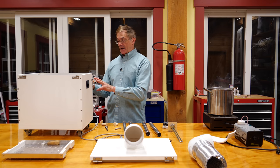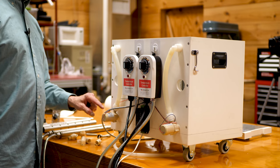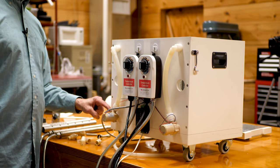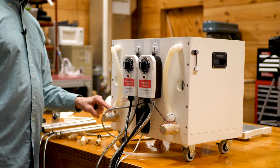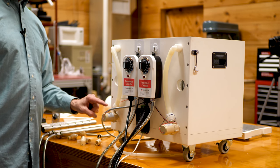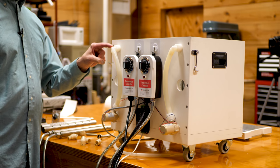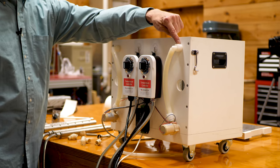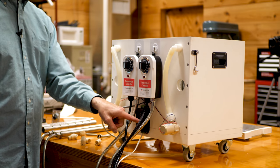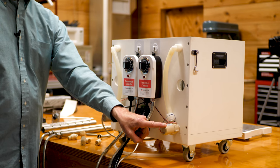On the back surface most of the action is happening. I've hooked up a couple of these solar water heater pumps — I really like these pumps. I bought them for about $20 each in quantity, but you can get them for about $28 to $30 each on Amazon. They are submersible 12-volt pumps good up to 50 degrees centigrade submerged, but they will pump up to 100 degrees centigrade boiling hot water. At less than an amp and 12 volts, they'll lift the water this high and move 8 liters per minute per pump. I have both pumps hooked up to a 15-volt power supply, getting 10 liters out of each pump — so I pump 20 liters onto the dry ice every minute.